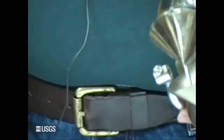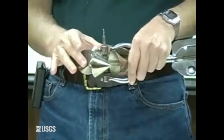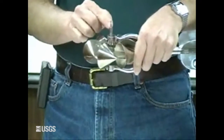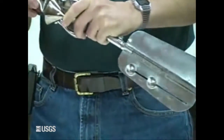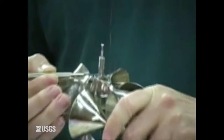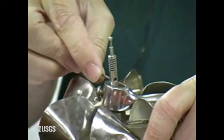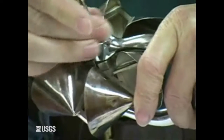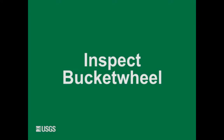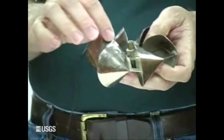Drop the pivot out the bottom. At this point, make sure you hold on to your bucket wheel assembly and shaft, because if you drop it, you could bend that shaft. There is a hole here where you can use a small screwdriver or an Allen wrench — which is easier to hold — to get it in the slot and twist loose. Go ahead and inspect the bucket wheel for cracks, cracked solder, and see if your cups are cracked.